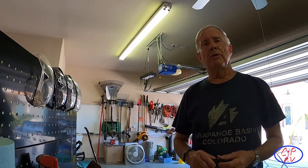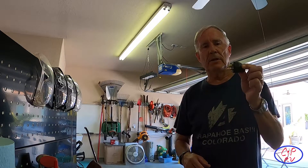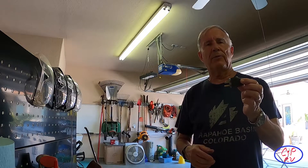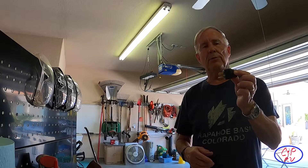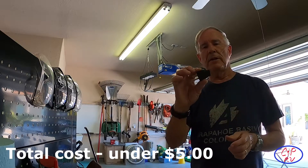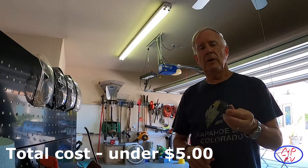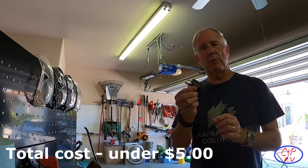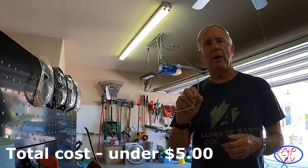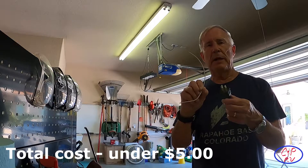It's going to force you to have one of these type of plugs, and so rather than buy one — which costs about $15 — we're going to walk through how to make a bonding plug from a connector that you can buy at Home Depot or Lowe's, a plug just like you would use to repair an extension cord, and a little bit of wire to make that plug.